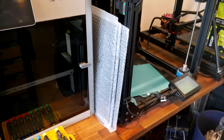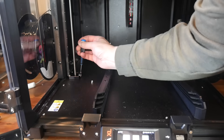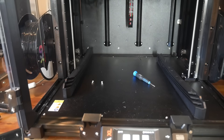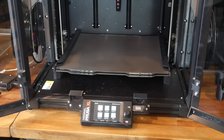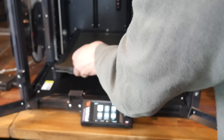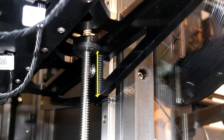This enclosure isn't the only modification I've made. The need comes from spare beds sitting between my other printers. I went for a three-plate version from Surfalex 2000, a prolific modifier of the Prusa XL. We have a left and right solid piece that sits on top of the Z-stepper motors on each side, with cutouts to mount in either a forward or rearward position — I went rearward for extra clearance with the enclosure. This also lets you use optional T-nuts into the back of the XL frame to cut down on potential vibration.